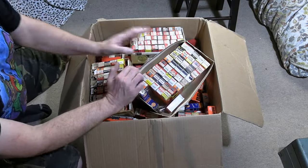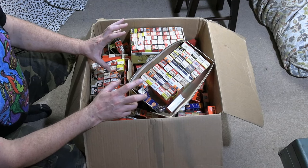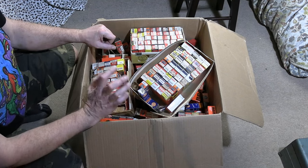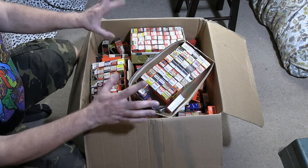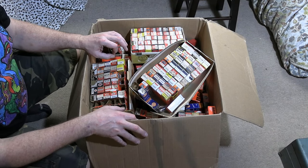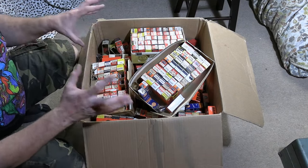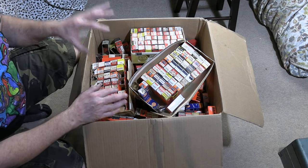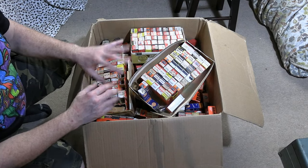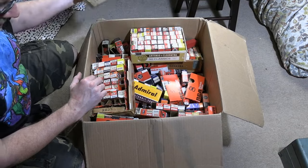For years and years, most TV filaments were 600mA. Series-strung sets were typically either all 600mA tubes or two strings of 300mA. Later, when you get to the 60s, they came out with cool chassis - Philco's term for it - with 450mA CRT filaments. A little more energy conscious, lower power TV. So they introduced 400mA and 450mA series-strung tubes. They also started combining more functions in tubes with two or three elements - not compactrons though. Some of these are probably also from the last rows of radios.